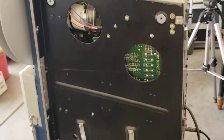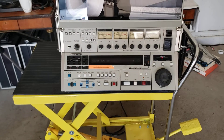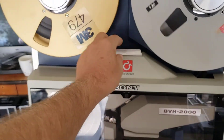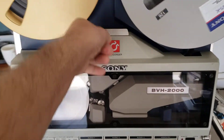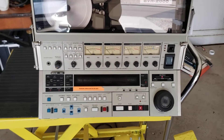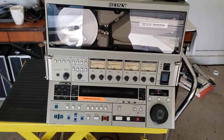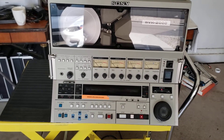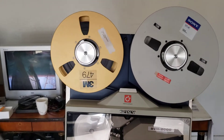I have a lot of fans of this machine and this is the final video on this, folks. I just got done rebuilding the machine completely. I rebuilt the cards which needed some capacitors that were dried out on the color section of the unit. I replaced the video head, which I had to get off eBay, and I did a thorough cleaning. I did all the adjustments, all the tension adjustments, and also the audio alignments because the audio was completely off. There were about ten different things I did on this unit. I wanted to get this thing as close to possible to how it was when it was new.